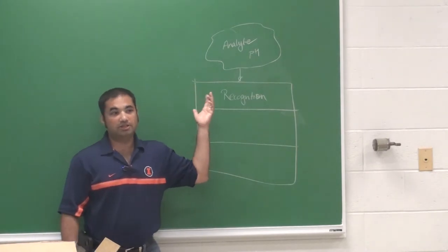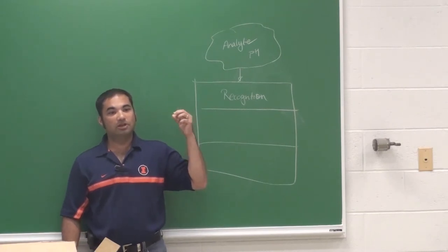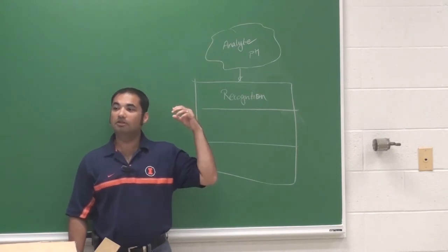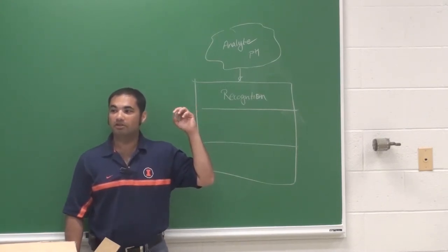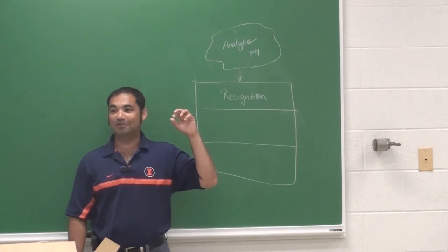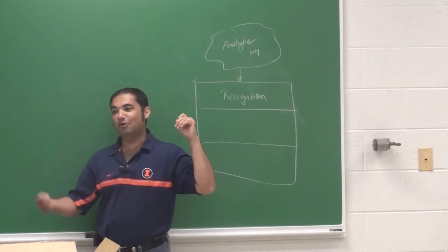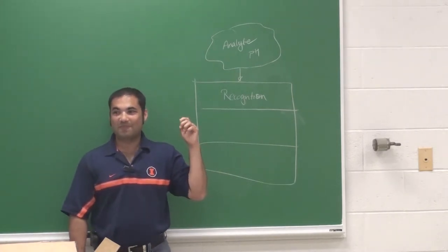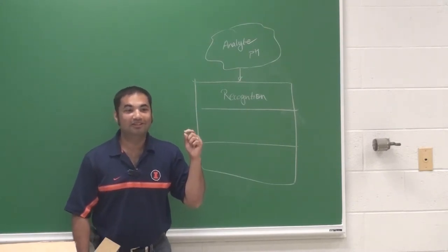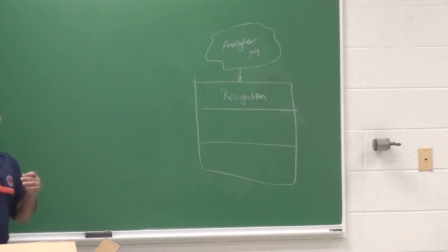In this case, you're recognizing pH, which, by the way, means what? What is it that you're actually going to be detecting? What physical element or physical particle? Something with what? Close. The partner to hydronium. No. Then you would be measuring pOH, right? Hydrogen? Not quite. You're one electron too much. Hydrogen ion? What is that called? A proton. Yes, you're actually going to be measuring protons.